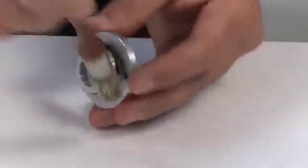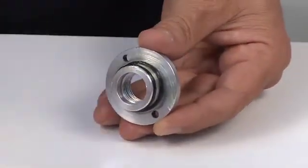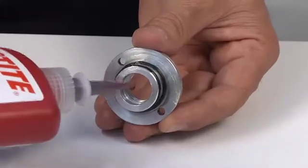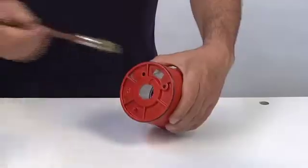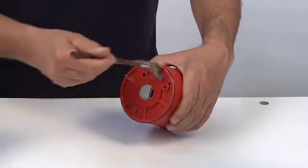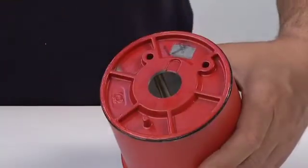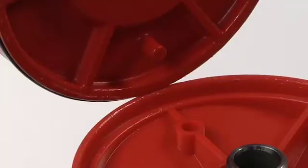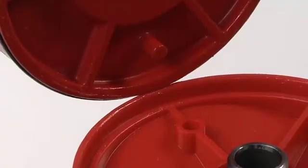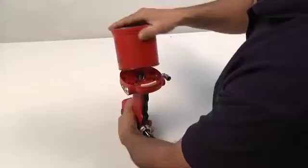Apply Panel special grease 2 to the gaskets of the ring nut O-ring, and Loctite 542 to the internal thread. Apply Panel special grease 2 to the O-ring gaskets and outside the pneumatic cylinder. Mount the pneumatic cylinder on the hand grip, paying attention to the coupling between pin and relative seat.